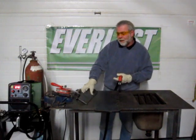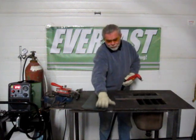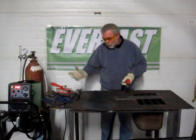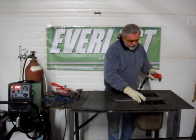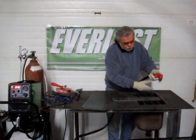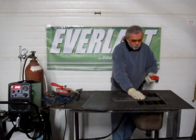We're running high amp on the unit itself — we're at 50 amps. That was just to demonstrate this. Now we're down to quarter inch, so you would tend to want to use somewhere around the 30 amp mark to cut this. We're not going to bother now, just going to show a simple cut. We've got a standoff on here, so that gives us the correct distance from what we're cutting.